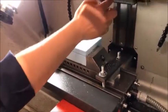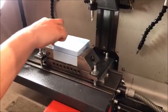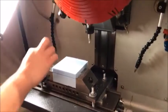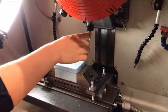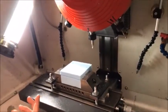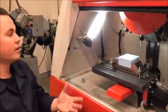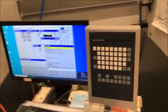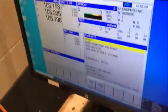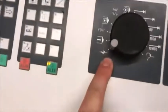If I set the origin on this piece, I need to tell the machine that corner is zero-zero-zero in space, the same as the tool — I apply an offset. The zero-zero-zero of the machine is called the reference point. When I turn the machine on, I can take it to a reference location — just set the machine down to its little target points and then press the button.